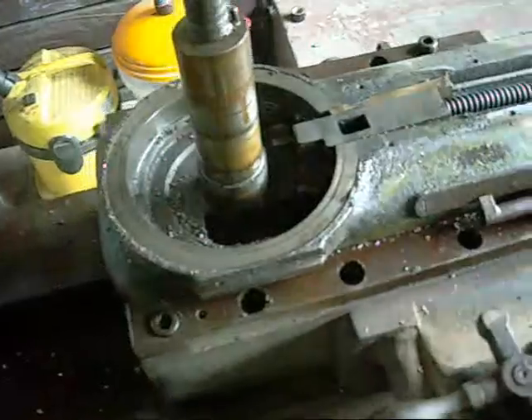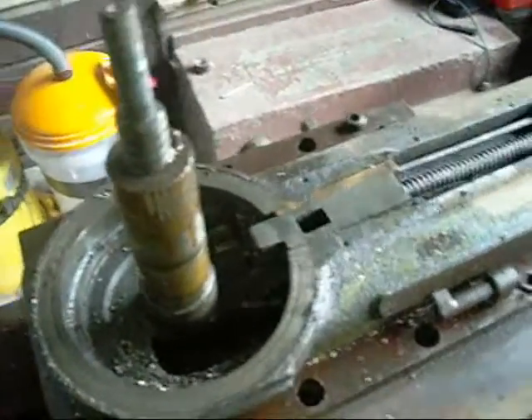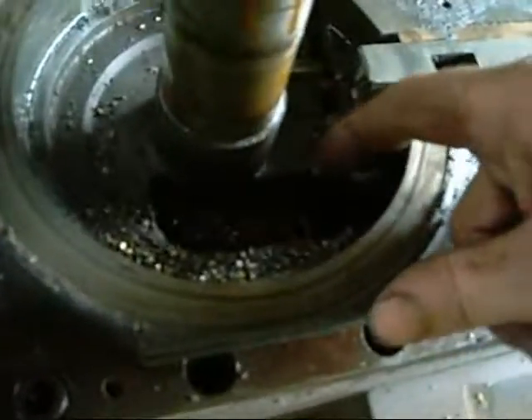This is what's caused it — they've used compressed air to clean the machine and it's gotten up into the rack and everything, and jammed it all up. Once I was able to trip that back, the turret came off pretty easy. I just retracted it a little bit and lifted it off. This little jigger here is what spins the turret; when you turn it back it hooks under there and rotates it.